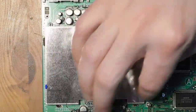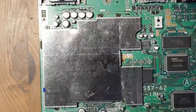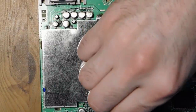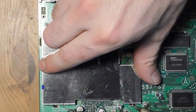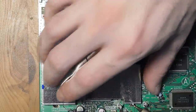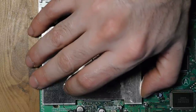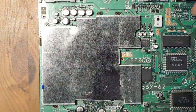The RF shield is soldered on the top side — not through-hole — so you can see the little pads. You just heat up the whole thing, melt the solder, lift the leg, and when it dries you can put it back. I'm going around the board lifting up all those pieces.